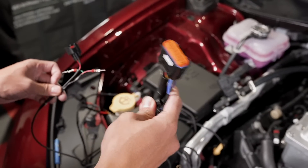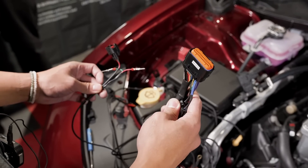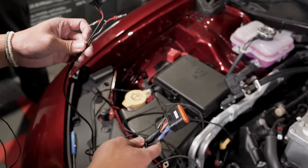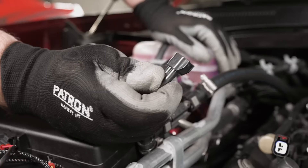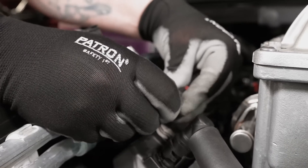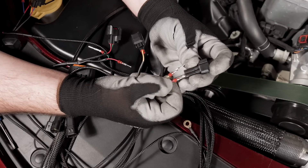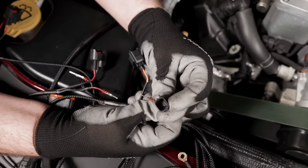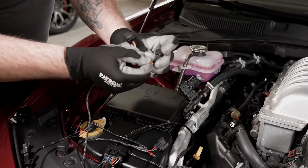Now that the polarity has been checked, it's time to install the wiring harness. There are two wiring harnesses provided in the kit. We will start with the main wiring harness, which you can distinguish by the orange plug. Remember that the red wire connects directly to the side where the multimeter was beeping. Test fit the male connector to help determine which side the red wire needs to be connected. It is important that the wire is in the correct position when sliding through the male connectors. Make sure the wire is pulled all the way through until it clicks. Ensure that all the wires are connected the same way.